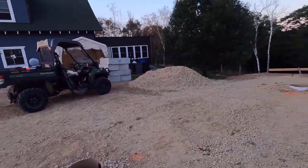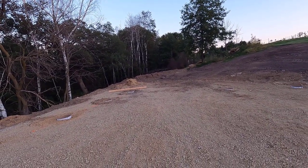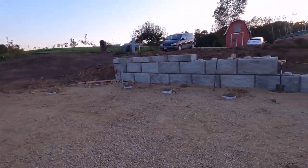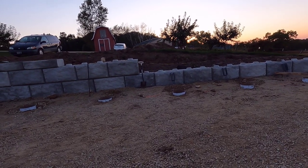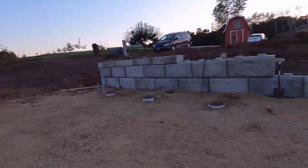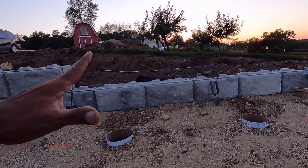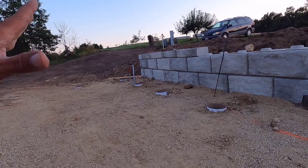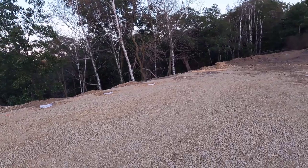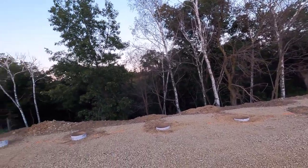They'll be just fine. So tomorrow, we're not exactly sure about the time. If it's going to rain, they're going to try to get here early, but if not, sometime in the afternoon, they're going to come and pour the concrete. Before that, Cindy and I are going to go around. We're going to put all the strings back on, fresh strings, and do all the measurements again and make sure we don't have any poorly situated tubes and make sure the building is the right size and is square. That'll be the last double check. Once you pour the concrete, there's no going back.